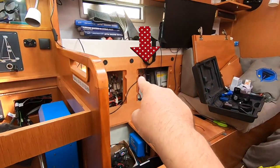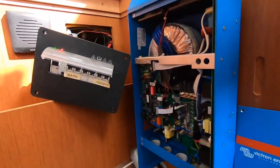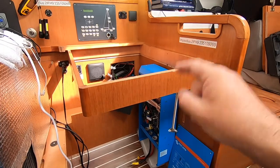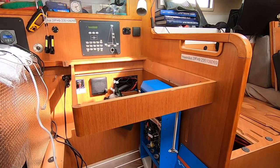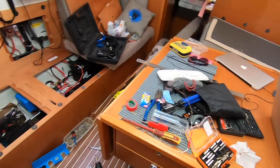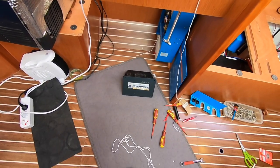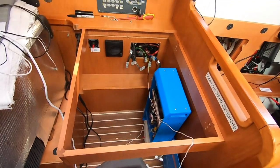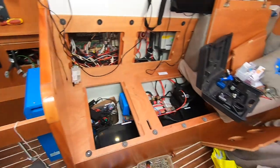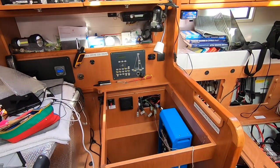We've got our big fuse and isolator over there. There's also another fuse in here. What I haven't got is a breaker between this and the mains, which I think I'm going to have to go and get. It's only got worse — I've had to take all the breakers out in order to split the power supply, disconnect all of those in there, pull a new cable in, and pull the heat sensor in to the lithium batteries, which meant pulling those cables through. Hopefully we can get this all in by tonight, otherwise it's going to be a very dark and dismal evening.